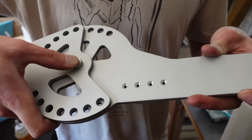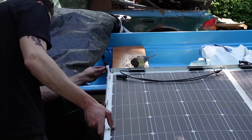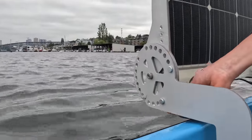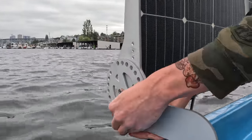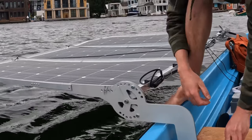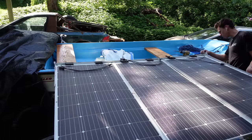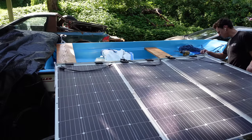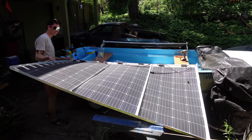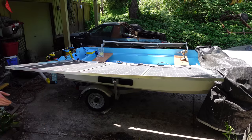For the center pivot part, I'm using a 3/8-inch shoulder bolt and a lock nut on the other side. All the holes in the outer diameter of the plates are spaced out so that I have a lot of mounting angle options for the panels when they are both folded out over the water and folded in for trailering. The angle is locked in place with two pins on each side. The issue with just having one panel installed is that it's too heavy for the benches, so they just tilt up off of the boat. So I had to get the other one installed to act as a counterweight. After that, I was able to lift the panels up for the first time and test out the support system, and it actually seemed to work pretty well.